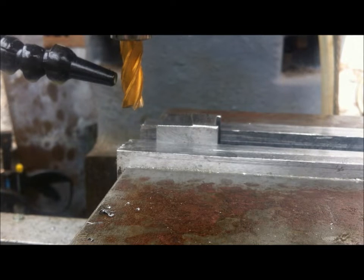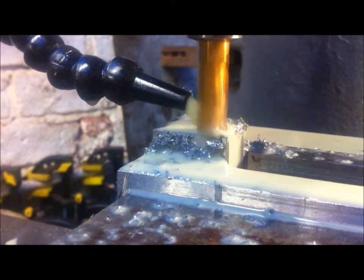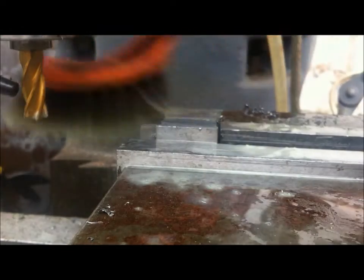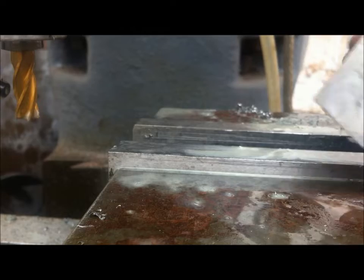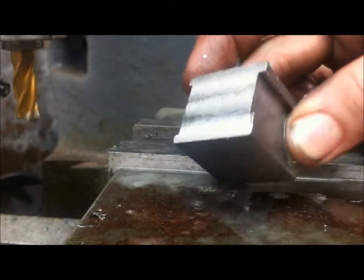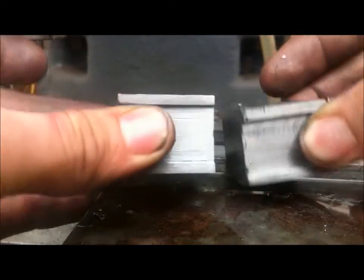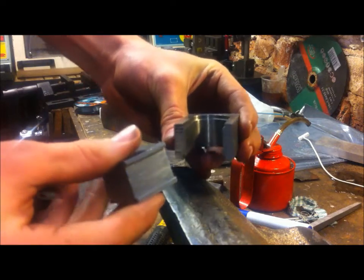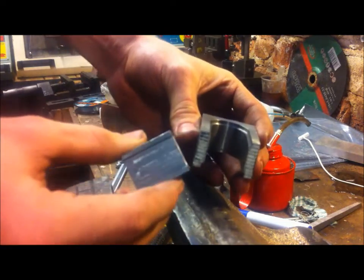I'm just about to square the tops of these blocks off and I'll show you them when I'm done. These are the blocks to fit underneath the bronze slugs. I happened to have some metal off-cuts big enough to get two out of one strip, so I've machined them in pairs. I am now achieving the final fit between the under-keep and the main body and just have a little bit of filing to do.